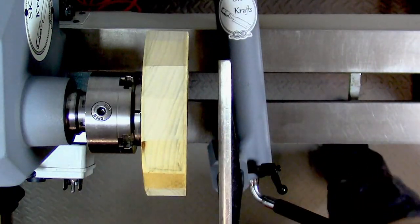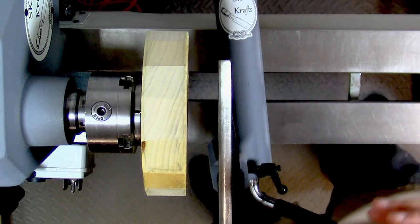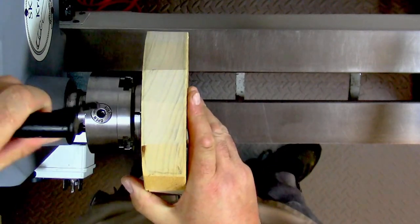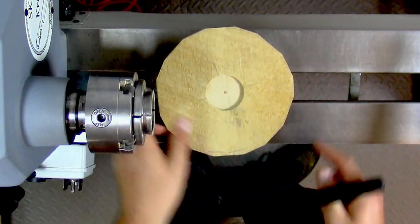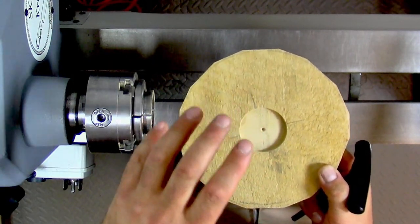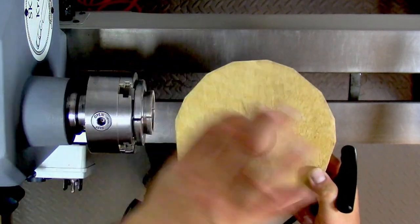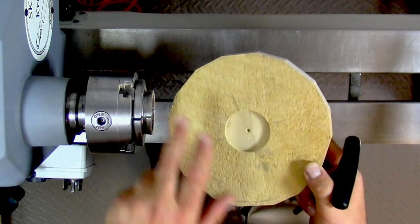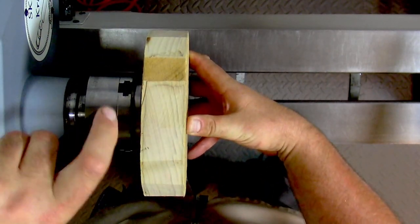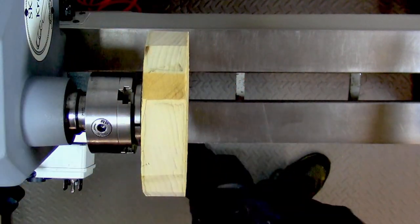Nothing high. We're not going to use a hard piece. We're going to use a soft piece of wood just to do this. So my personal preference, before I start turning, is 9 times out of 10 I will use a 54 mil Forstner bit to create my mortise in the back. That gives me a nice secure clamping point because I use the Record Power SC4 and SC3 chucks. So 54 mil is the perfect size for the SC3 and 4 clamping, sorry, not 2. So that's perfect. I drill that on the pedestal drill, which gives me a nice secure fixing.